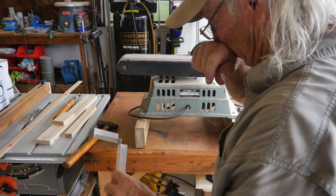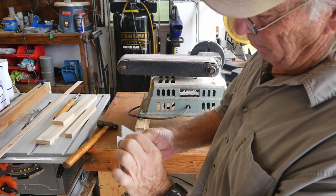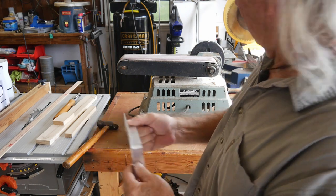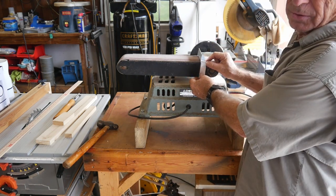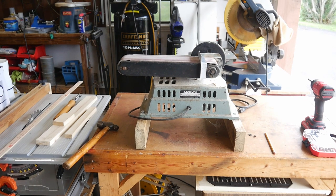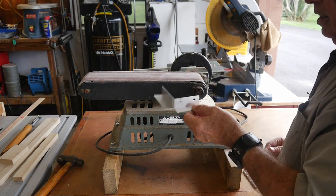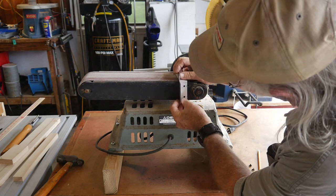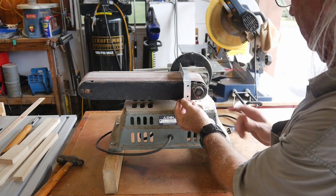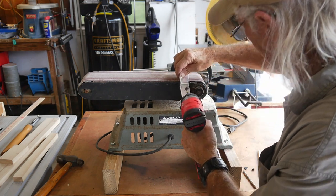We're back — I bent this, cut it with a hacksaw, put it in the vise just below the cut, did the bend, took a hammer and made a pretty nice little 90. This will go right up here on the screws. Hopefully that'll work as a basic fence — it's going to close up a little bit tighter there. I took a shot at this with the drill and the holes are dead on where they need to be, so we're good. I'm going to put these screws back in and have a look at the fence overall.